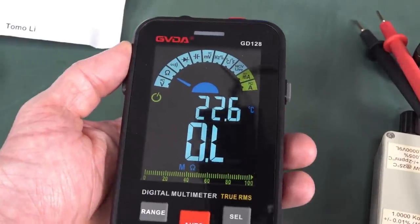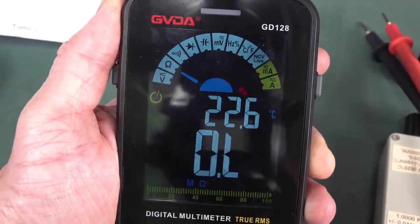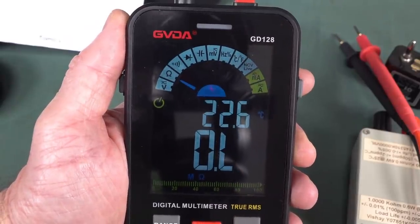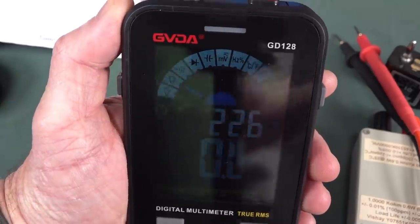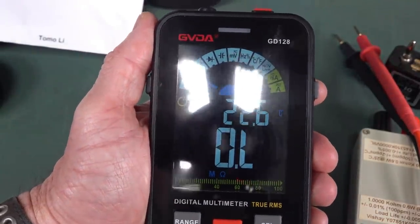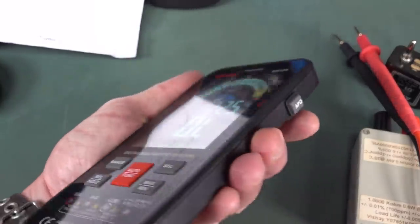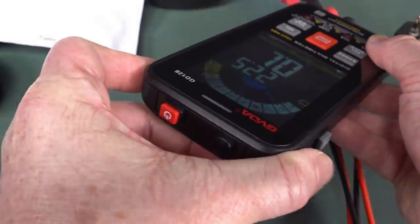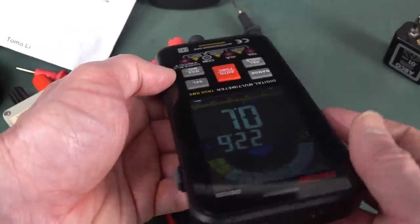And the contrast of the screen might look good at this angle, but you turn it completely face on, it might still look, oh, it's flickering. It's flickering. I can see it on my camcorder screen. That's got to be the LCD refresh because I don't have flickering lights here in the lab. All my lab studio lights do not flicker. So yeah, it just vanishes when you turn it up at any sort of angle. Even 90 is not that great. You've really got to view it at shallow angles like that. It's really good at these sort of angles, but the other way is just awful. It almost vanishes. I can still read. Yeah, that's probably equivalent on the camera to what I'm seeing. But yeah, it's not great.